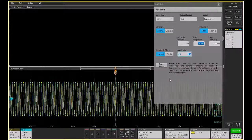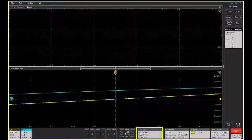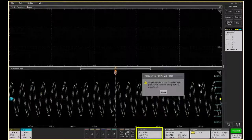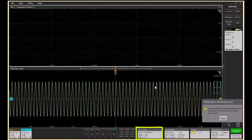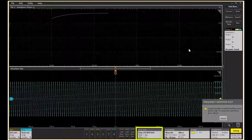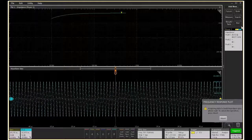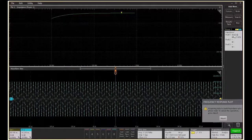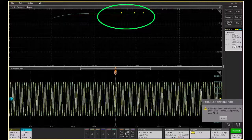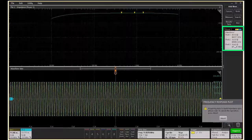Here we have selected 1 volt, and once we set the power preset, the software automatically has invoked the AFG option, and now the software starts sweeping from start to stop frequency. The signal from the AFG output through the power divider, whether passive or active, is fed into channel 1 for reference, and channel 2 is coming from the reflected signals out of the DUT. The output of the DUT is connected through the J2113 or J2102 Picotest transformers.